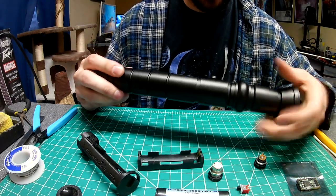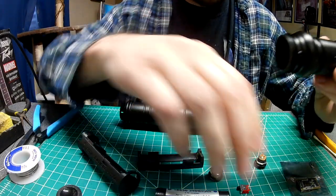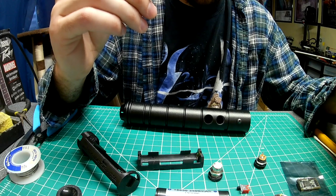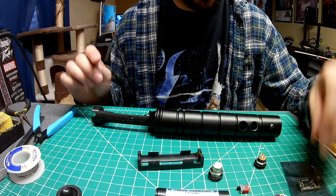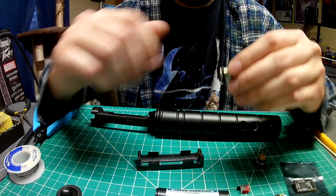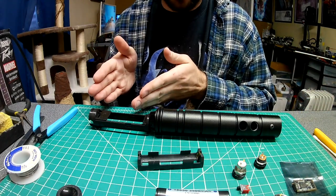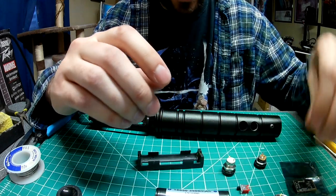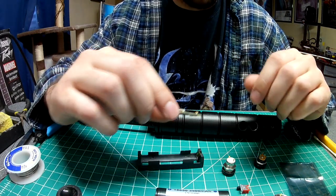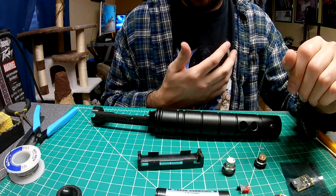Now with this hilt comes a part up here, and this is where a great deal of thinking comes into it. Seeing this, I know that this is going to be the NeoPixel retention. That gives me an option: do I want to wire to the board or from the board? I think it'll be a lot easier to solder from the components going down into the board. This board is so compact and requires so little wiring that it's really not going to look much better soldering from the board to the components. That approach mainly helps your board look cleaner in certain chassis setups.